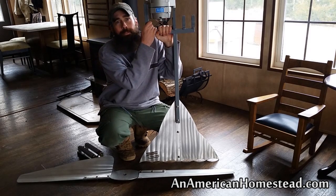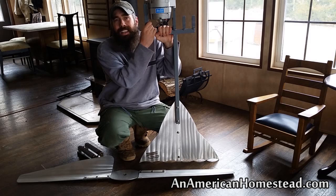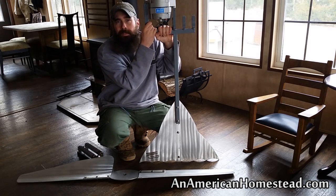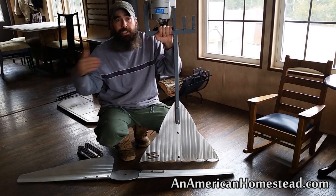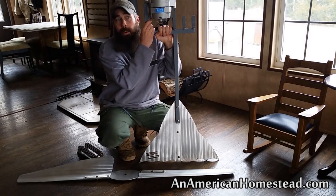To produce about 24 volts, you need to get it to just before 300 RPMs. At about 300 RPMs you're going to be producing about 24 volts and about 6 amps of power for our system. At about that point you'll start to be able to charge our 24-volt battery bank and get about 6 amps of power, which is pretty good.